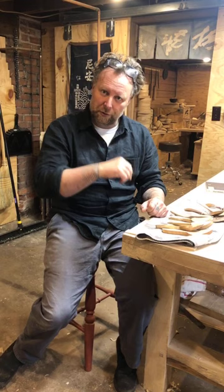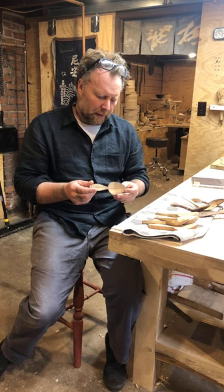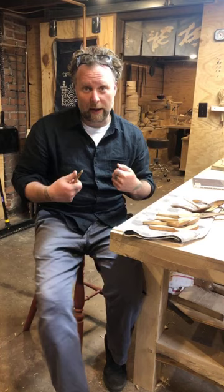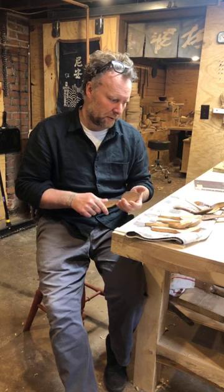Drawing seven at a time, then go to the mule and carve the plan view with a draw knife — instead of having to use my hands and a sloid knife. And hollowing with a bent shaft tool I call a skaver, a Swedish generic name. Then hollowing, then doing the underside, putting the crank in, and finishing by just knife work at the end. With that I was able to really get a lot more done more efficiently — efficiently meaning less time and energy. For me and my time and place in spoon carving, it was a huge game changer.